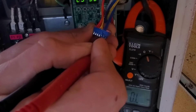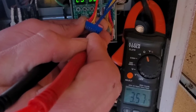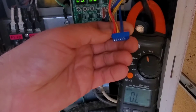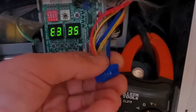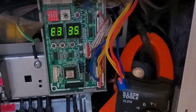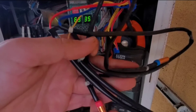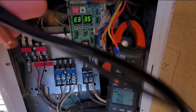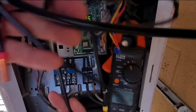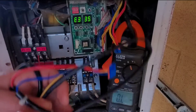Now sensor number three — 3.5. You see that? That little inconsistency right here — this tells me this evaporator three sensor is bad. So that's why I ordered new sensors and I've got them here. Sensor number one, sensor number two, and then the blue one which was bad was sensor number three.